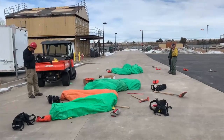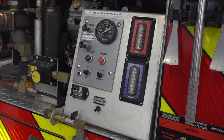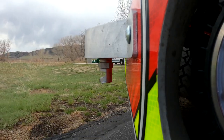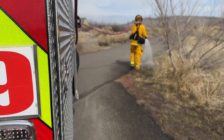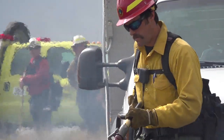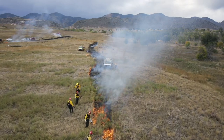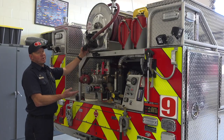This is the pump panel of the Type 6 engine. An 18 horsepower engine drives a pump to supply water to the various pre-connects from the 300-gallon tank. All these valves send water to different parts of the truck, whether it's nozzles on the corners of the bumper and tail or through the pre-connect hose reel. The most common use of a mobile vehicle like the Type 6 brush truck is mobile attack, where we use the hose reel and extend it out the front. A firefighter walks on the ground fighting fire while the driver uses the vehicle to bring the 300 gallons of water with the pump along with the firefighter. That's what makes a Type 6 engine valuable — the mobility component.